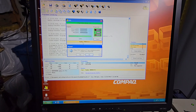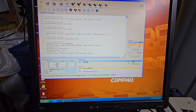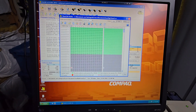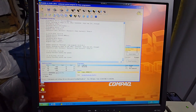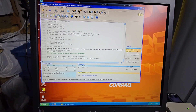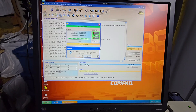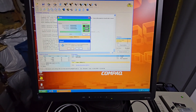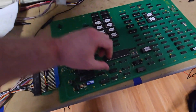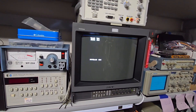Now let's read it into buffer — buffer view, it's all zeros. Now let's load NVRAM, open, and program that. It should verify fine now — boom! Alright, it verified, it's exactly how MAME had it. Let's put it in the game and see if it makes a difference. Got the chip in, cross your fingers. NVRAM OK — it does work!